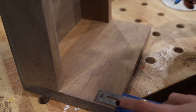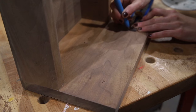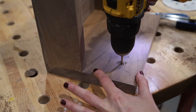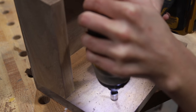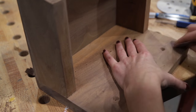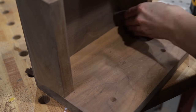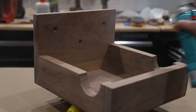In terms of what was left in the process, I needed to pre-drill some openings to add screws through to screw into the actual wall. Just like the back of the bike rack, I used my countersink drill bit to make countersunk holes so that the screws sit further inside the build — it's a sleeker and neater-looking method of hanging screws through this wall-mounted bike rack.